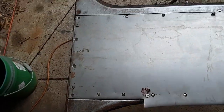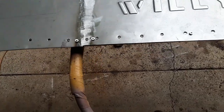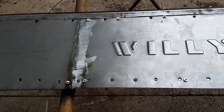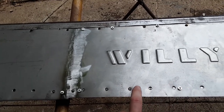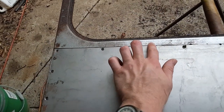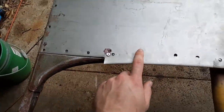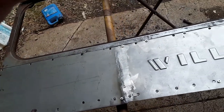Alright, I'm about to start welding. Got it all screwed on there good. One little tip — when you're welding and there's a big gap between screws, I'm going to put a clamp on the sides at every spot all the way around. I also ground the back side to get the burrs from where I drilled the holes off so it'll sit flush.